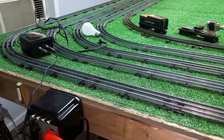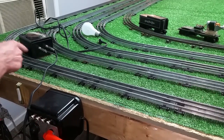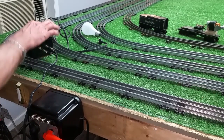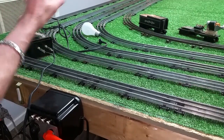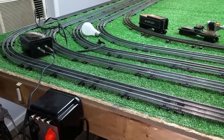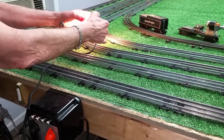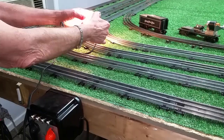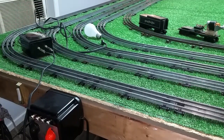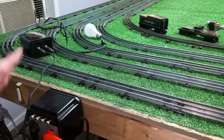The output of this transformer connected to the output of this transformer — turn this transformer all the way up, it is now a step-up transformer and gives you 110 volts out of the cord. It works absolutely perfectly. It's simple. The best thing is if you want to run power at a distant location, you don't have to run 110 volts over there. You can run low voltage and then just step it up at the other end.